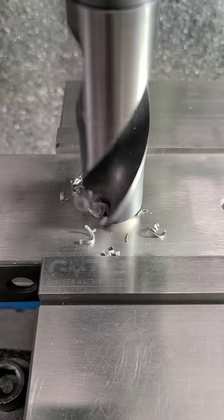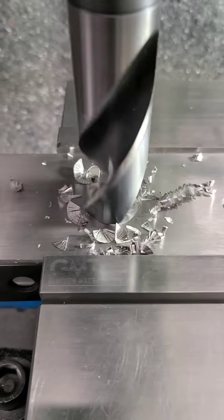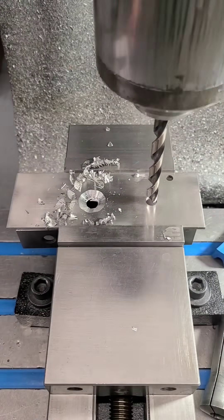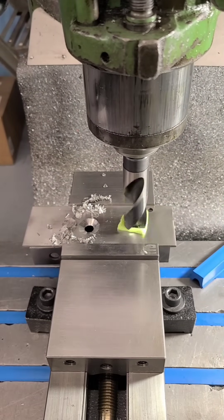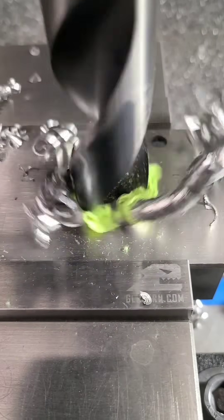This one is a classic. We have a large drill and we're trying to go through thin sheet metal. The drill is actually spinning at 80 RPM here in this video — it's just sped up for the clip. But as you can see, chatter can develop. What happens is, as the point goes through the material, it's no longer supported and you have a constantly developing cut that gets larger and larger.